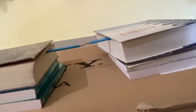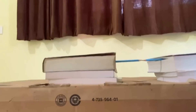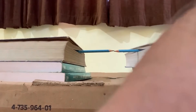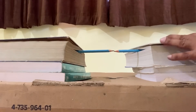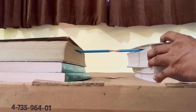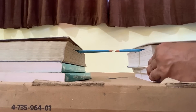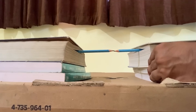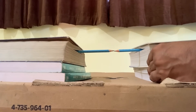Removing the parallax means bringing the two objects actually in a line. In fact, I can show you from a different angle and you can see that they are absolutely not touching each other — they are absolutely not in the same line. So removing the parallax means actually making the two objects in the same line, and now I am doing that by shifting this book, bringing it so that now they are actually touching.